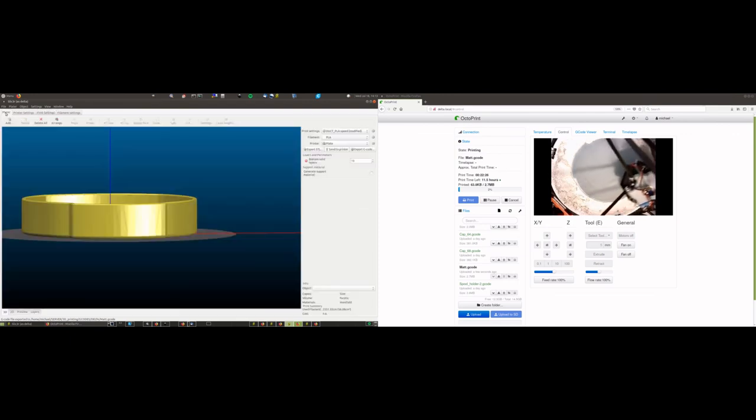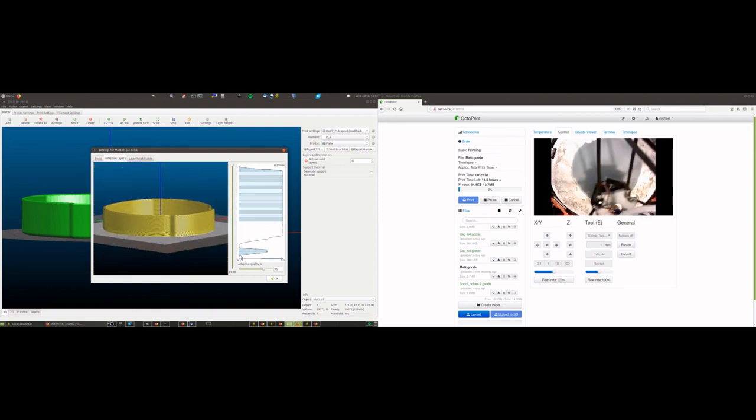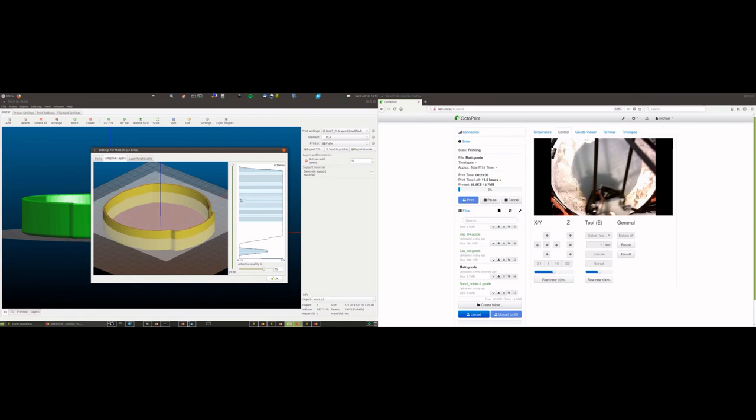So what I'll do, let's have a look at the plater. You can click on the object and check layer heights, and you see kind of a profile. Where it sees more detail, I've got rounds in the design. Where the bottom edge has got a round, and then it's vertical sides, and it does it in larger layers. Then we get another round, a whole lot of rounds on the inside. So to improve the quality, it reduces the layer height. So it's generating more layers. So it spends a bit of time on making a finer job of it. But as we've just got the vertical, then it bumps back out to the layer height that I specified.